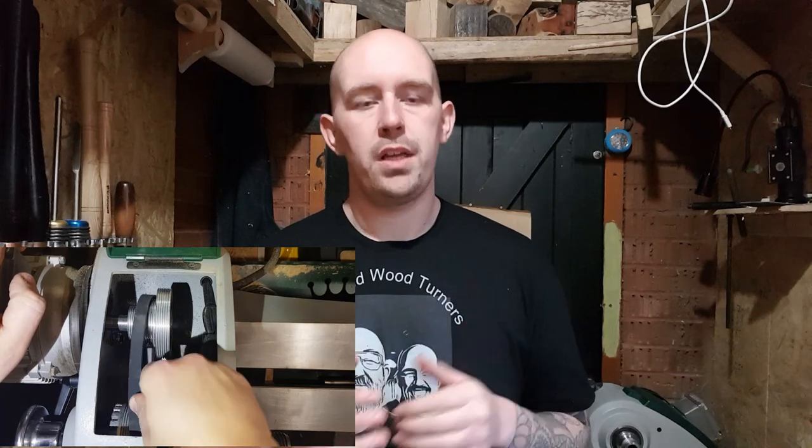Next we have the pulley wheels. The number of pulley wheels inside your headstock will depend on the lathe you are looking at. Most electronic variable speed lathes will have two or three pulley wheels. Lathes like my CL3 had five — those five pulley wheels determine the five different speeds that you have, and you have to change them manually by moving the belt from one to the other. Generally if you're buying a brand new lathe you'll receive an instruction booklet telling you what each pulley speed is.